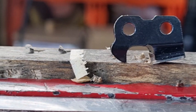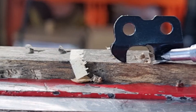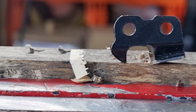The reason I'm doing this video is to put a few myths to rest, where people say that the gullet plays a major part in chip clearance. I can't see it — honestly, I can't see it. To me, what plays the most part in chip clearance is the gap underneath here, the chip channel. I'll post a picture from Stihl that talks about chip removal, so you've got information there if you don't believe me. Stihl are saying exactly what I just said: the chip goes through the chip channel under the top plate out the back, bang into the raker. I'd just like to clear that up — thanks for watching, bye for now.